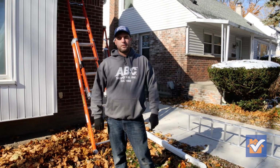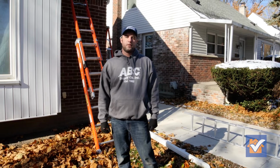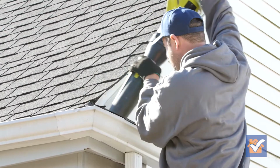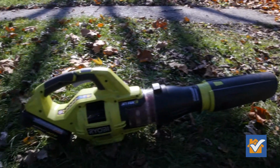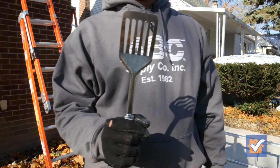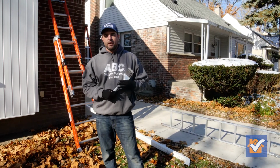Hi, I'm Christian. It's that time of year again and everyone needs to clean their gutters, and that's what we're going to do today. Obviously you can clean your gutters with your bare hands, but if you have a blower, you can blow the loose stuff out first. If you got a spatula, you can scrape the bottom really clean. Gloves will keep your hands dry and clean.